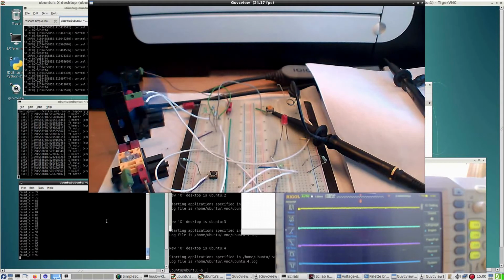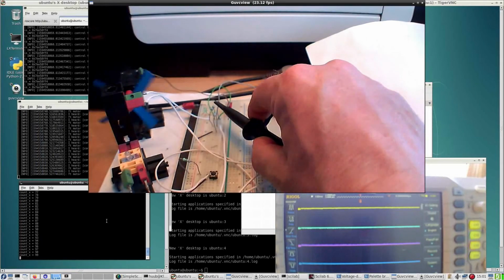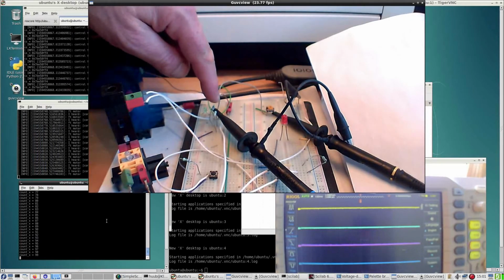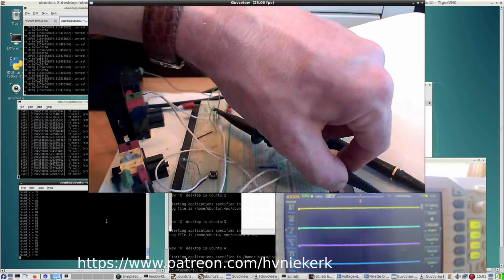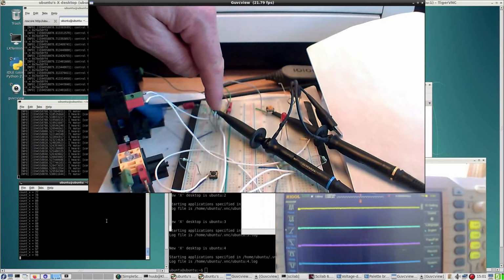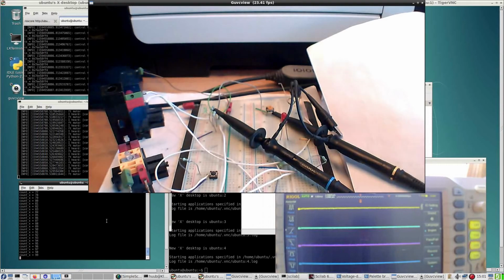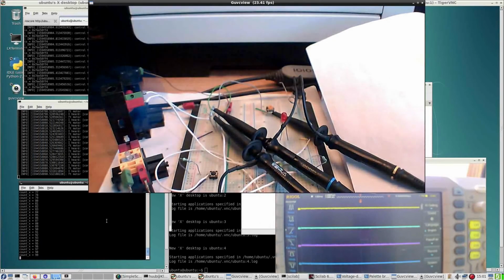Murphy's Law, I don't know, but let me take the second probe, which I had prepared, and put it right here. So now I'm measuring here a voltage which comes from the phototransistor. Then I have another probe that I can use to measure the voltage from the divider, and then here as well, with still the question, why doesn't it work? Third probe. And that one, as said, goes here. Oops.